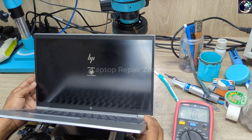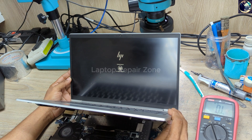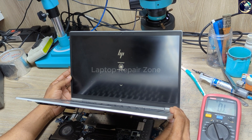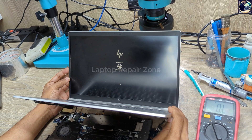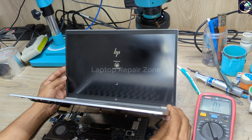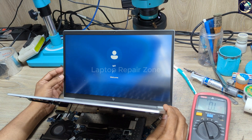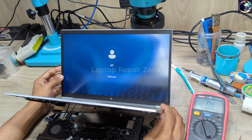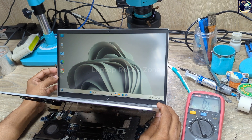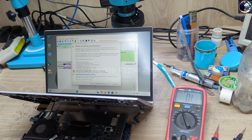As you can see it's done — we successfully fixed this motherboard and it was very easy. To confirm a 3 volt regulator IC is bad, you need to check only the V-in voltage and then the LDO output. If V-in is present but LDO output is not present, then you can also check the enable voltage — it should be on pin number 11. That's it for today. Thanks for watching this video.